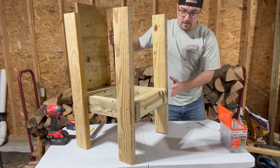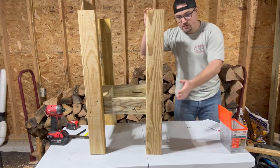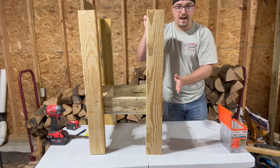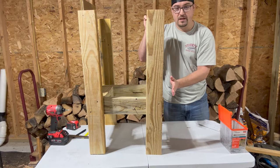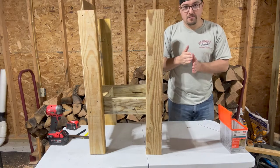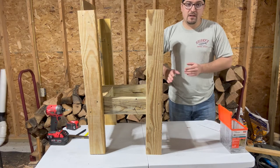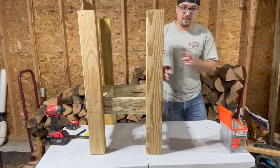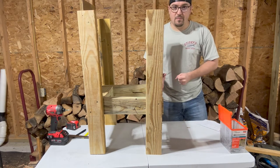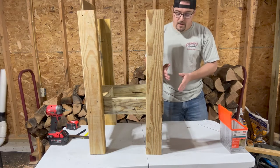Let me explain what I did. For this leading edge here, and I'll show you some close-up pictures at the end, the open end where the logs will overhang, and this is where you will be cutting, you do not want the legs to be up against the front of the jig. You don't want to accidentally cut into them, and there will be a little bit of excess space because of the chainsaw that will prevent you from getting up against the measured width, okay?